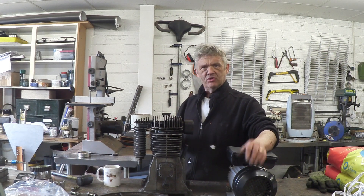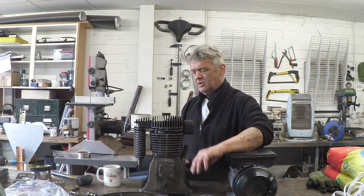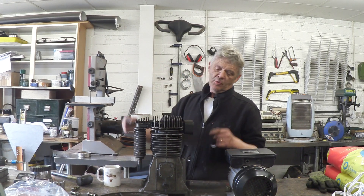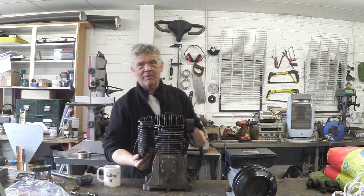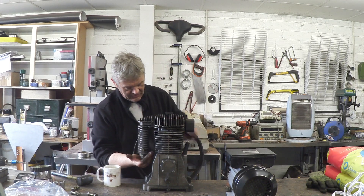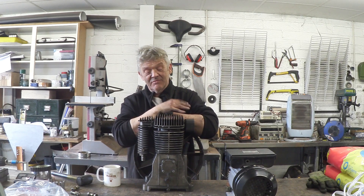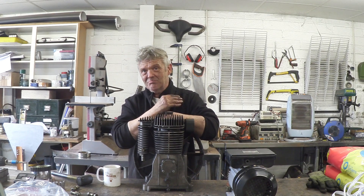Okay, there's not a lot to it! We've pulled off the major bits: the electric motor right here and the compressor section. The tank section is still outside and has the control valve on it. It's pretty dirty so it does need a clean. It's going to be something like the bearings, piston ring, or something like that — but in here those piston rings are plastic. Of course you never do anything without first testing it, so if I put the flywheel back on and give that a spin by hand, I'm actually getting compression in there. I can feel that airflow, so chances are there's nothing wrong with this. It turns quite smoothly, we're getting compression, so there's nothing to do with this apart from clean it — and that's exactly what we're going to do.